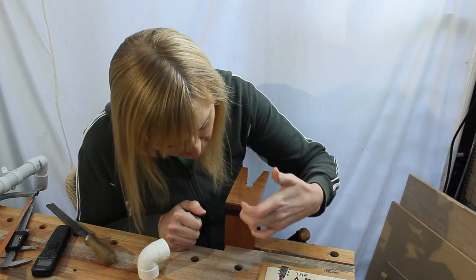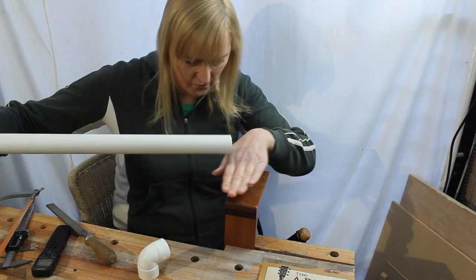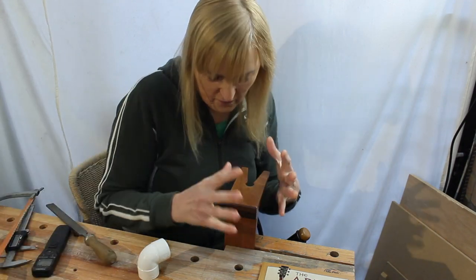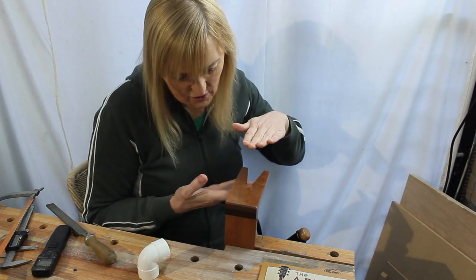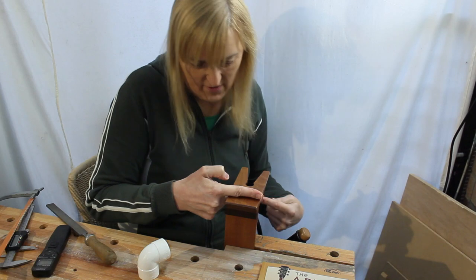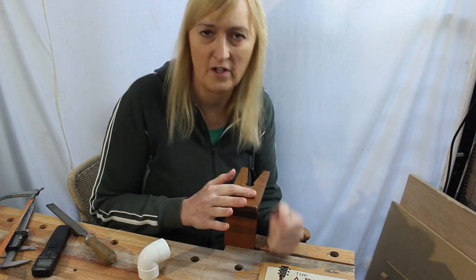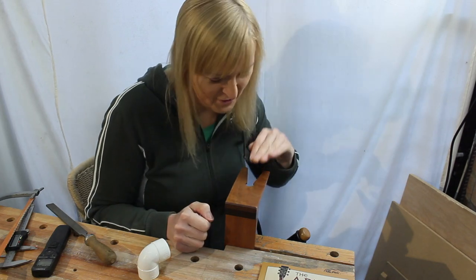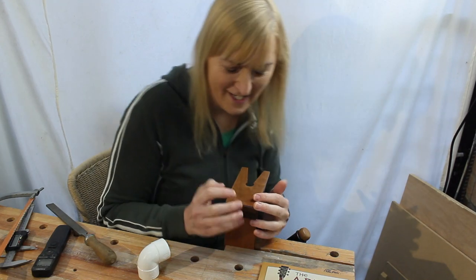So yeah, I'm gonna cut through the back here. And I'm going to have my waste pipe slotted so that it will fit both half above and half below. And hopefully we shall get a system very similar to Larry Robinson's, where we're extracting both above and below the board. And the dust port will be about here, I guess, and a little bit closer underneath. Whether or not I put a grill over the front, I don't know, because clearly if you've got a strong suction just by your work, you've got to be very careful you don't let the inlay pieces get sucked into the pipe. I'll see whether we need a grill over it later.